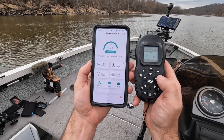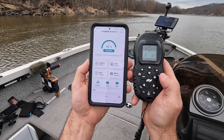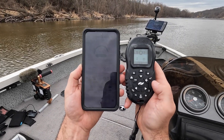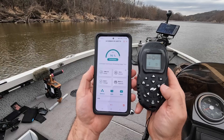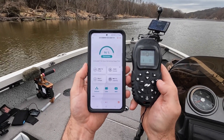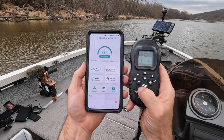Let's get her up to 4: drawing 5 to 6 amps, 20 hours at a 4 — still pretty good, more than a full day of fishing. Up to 5: I'm on a river so I'm fighting a little bit of current, but we're starting to keep up. 10 to 12 hours at a 5 setting — still pretty good. I also have the trolling motor on autopilot, so it's sort of self-driving, which could be drawing a little bit of current. Up to 6: having it at a 6 all day would be kind of crazy — that would get us 8 hours continuous on a 6, and I don't ever see that happening for my purposes anyway.